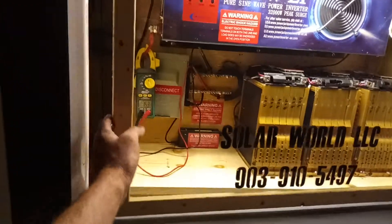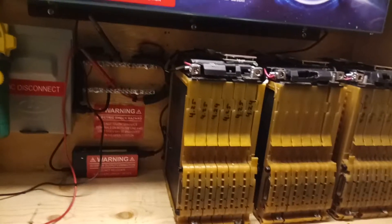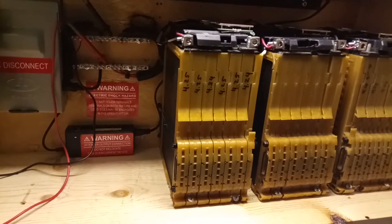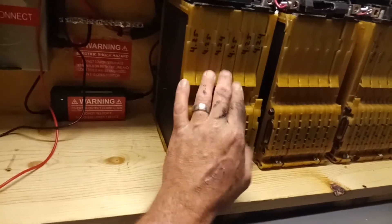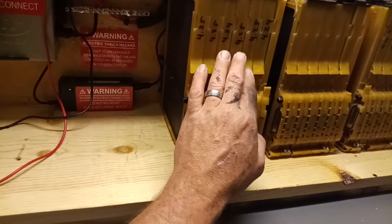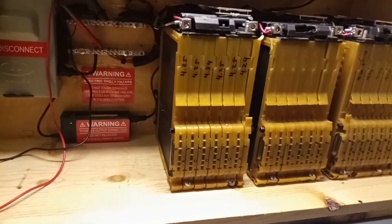Let me show you what's inside. We have three GM lithium volt batteries running at 25.2 volts, roughly about 200 amps per pack. So I am registering somewhere around 1400 usable watts, around 1200 on average per pack — so about 3600 watts, 3.6 kWh for this particular system.